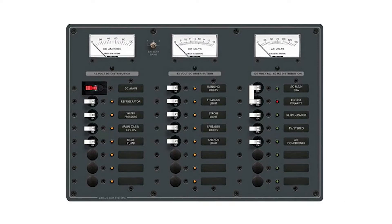People add circuits without protection. They might have the ability to turn a circuit on or off, but they never thought about what happens in an over-current situation — when the current on the wire exceeds the rated capacity of that wire. When that happens and you don't have a circuit breaker, the wire becomes the circuit breaker. It can, and does on rare occasions, literally catch on fire — it becomes the fuse. That is a common way for an electrical fire to happen on a boat.